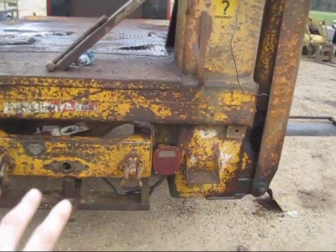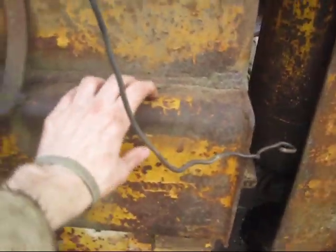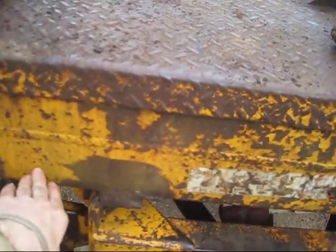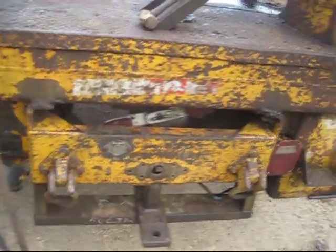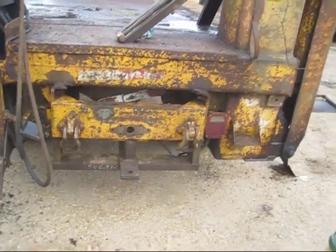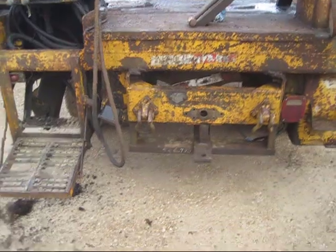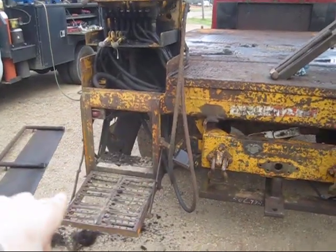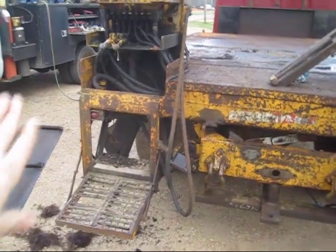So my plan is, if you follow me here, we're going to come out from this nice piece of toolbar. It goes all the way to here. We're going to drop down a couple inches and come out. So there's like a step there. Come out here at about 30 inches, box it all in, probably put some plate around it, and we'll inset the lights, the back lights on there, and put a trailer hitch in it. So that's the plan. As for the little platform, we're going to do away with it. It's going to be like a 90-degree deal that's going to fit all in there.